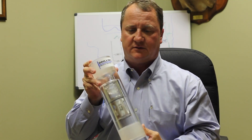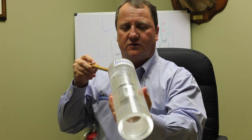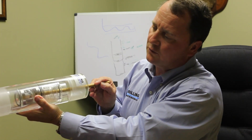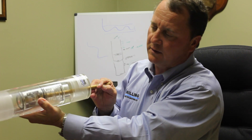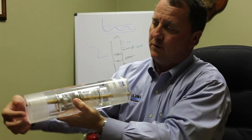The main benefit is the fact that it is a full opening ball valve, which when you flow through it, you can see that the flappers recess into the ball to allow for a full flow through the valve.